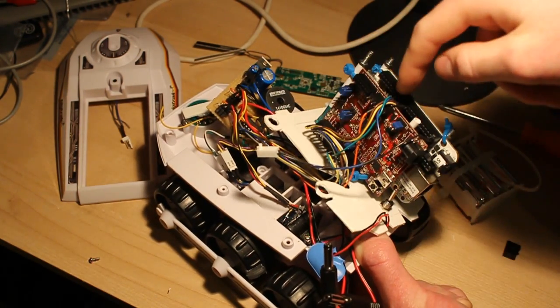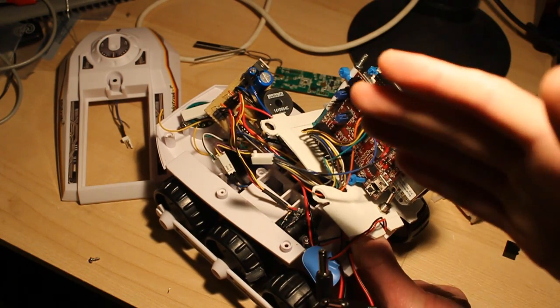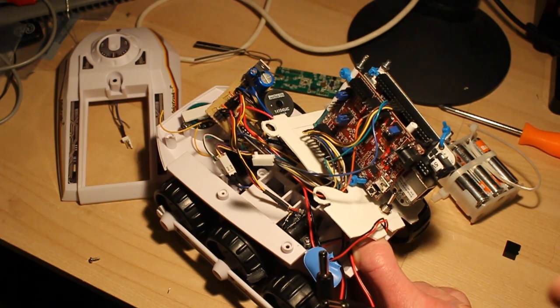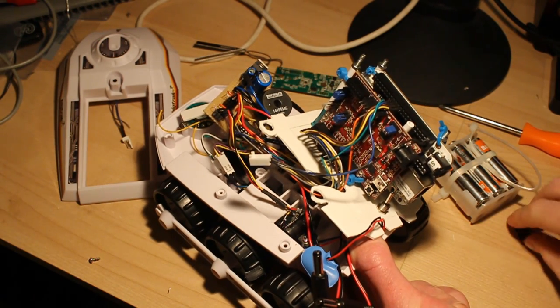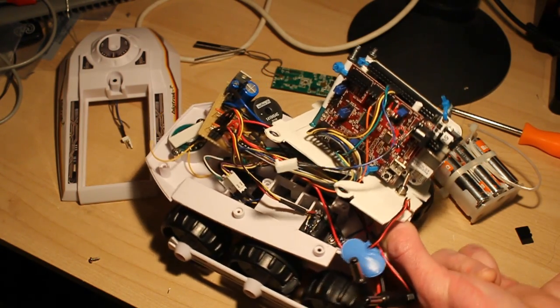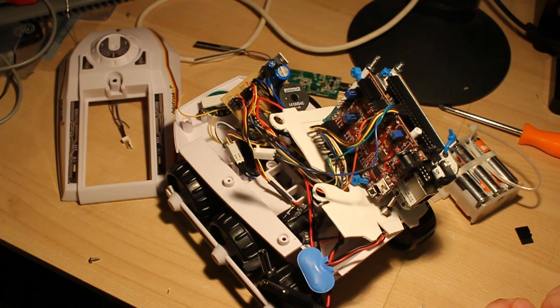Serial port, the command is basically two signed numbers, so 100, 200 would make the left wheel go 100 steps and the right wheel 200 steps, or more usefully say 100, minus 100, which would make it turn by 100 steps. The conversion between steps and degrees and everything is done in the Python, so it's dead easy to tweak what that does.